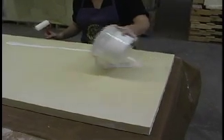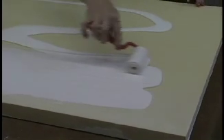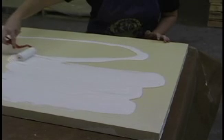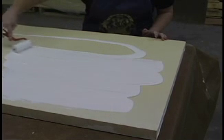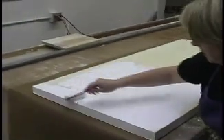When rolling FSC88WB, reduce it with water to a milkshake-like consistency as Kelly mentioned earlier. Using a short nap roller, apply a smooth, creamy coat making sure to work it into the cells of the precision board. Do not use a foam roller as it will pick the primer back up, resulting in a thin mill build and not enough primer thickness to sand smooth. This is sometimes indicated by a textured orange peel surface. Again, if a second coat is required, wait until the primer is tack free and then you're ready to apply your next coat.